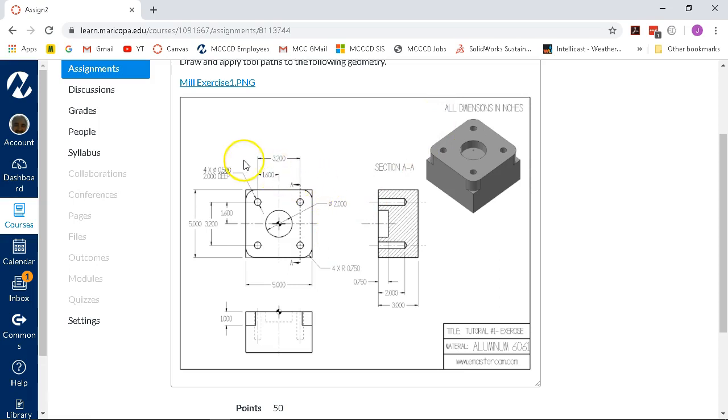All right, so things to look at. Again, the 5 by 5 by 3. If we're holding on to this in the standard 6-inch vise, that's going to be fine. I may go in and go ahead and go the 5-inch width, whatever my saw cut is. Take a little fly cut, get it close enough. Make sure that there's no perpendicularities, there's no datum callouts that are really tight controls that we're going to have to contend with as we go through the machining process. So that's going to drive some of our geometry. The other thing would be, can I hang this off and machine the one side.